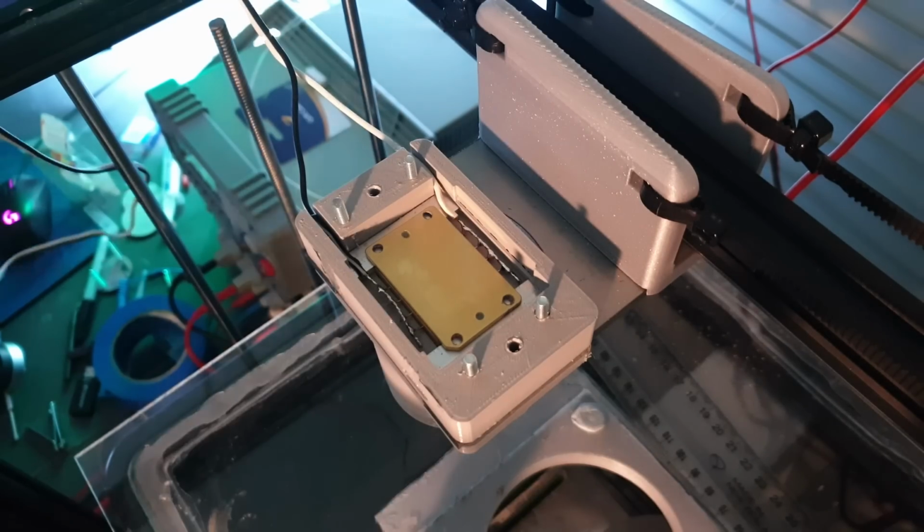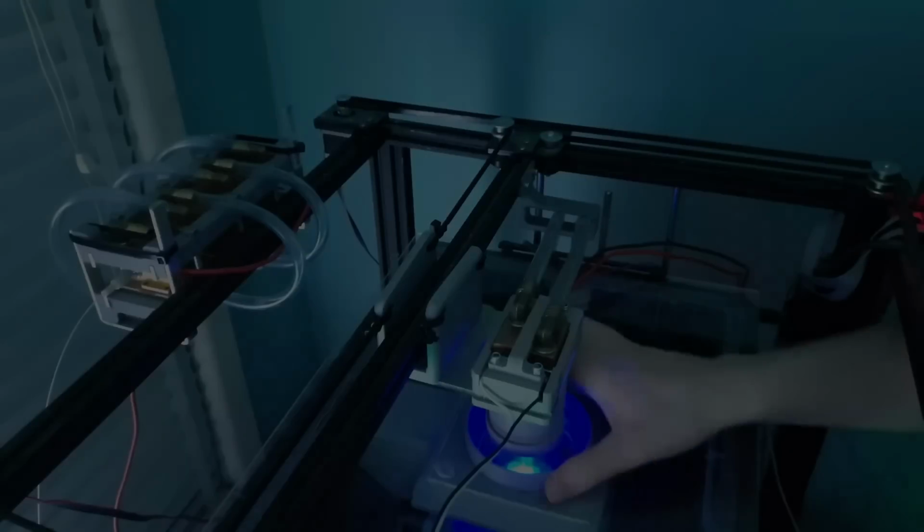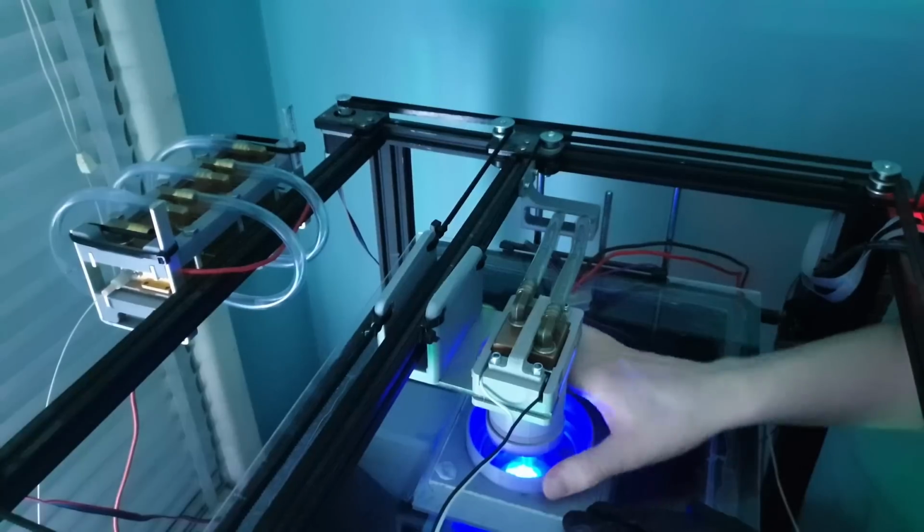Since I was doing this on a whim, I decided to use the NUBM31 I had lying around, just to keep things simple. This would be shy of around 35 watts compared to the laser head using the two NUBM38s, so to compensate, I mounted the window further down into the enclosure so I could use a shorter focal length and achieve a tighter focal spot.